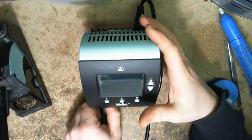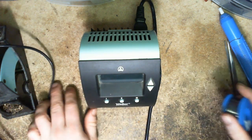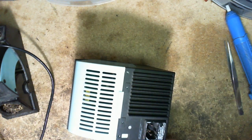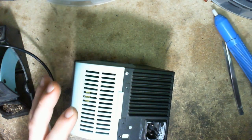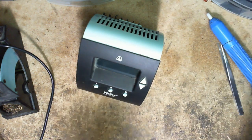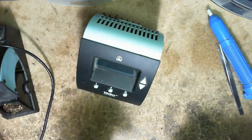So I ended up with a WD1 soldering station and an iron for it — that was a garbage throwaway really, because someone didn't know how to change a fuse. And to be honest, we didn't expect there to be a fuse in there anywhere. If you had Googled what to do, the main fuse in the back had not gone bad. Now I have a proper station, after at least 15 years of soldering, to do surface mount work with. Not to say that using fine tips on older irons won't work, but — ta-da! A proper station, and it was easy to fix. How much was this fuse? Mine was a salvage, but I would dare say under $2 to fix a $200 soldering station.